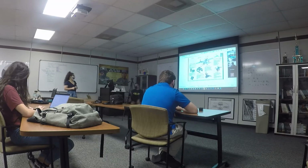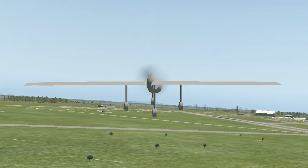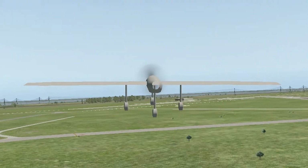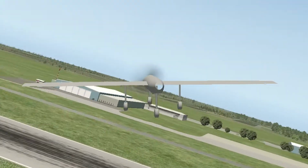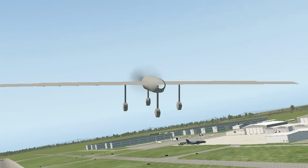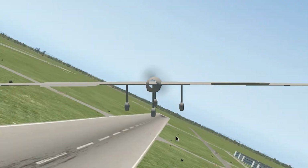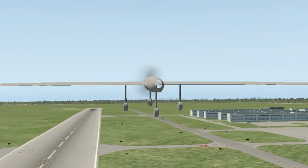By having a Morphing Wing, essentially we were able to do the job of two different fixed wing aircraft, being able to take off in a shorter distance and have a higher climb rate. Once we reach altitude, we were able to retract our wings and move at faster speeds to go from point A to point B until we went over our LZ. Once we were there, we'd extend our wings for surveillance, glide for a period of time, retract our wings, and quickly leave whatever area we were doing surveillance in.